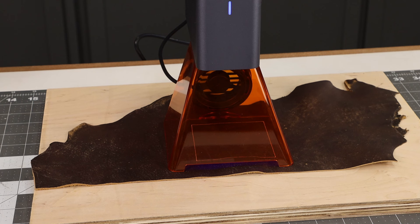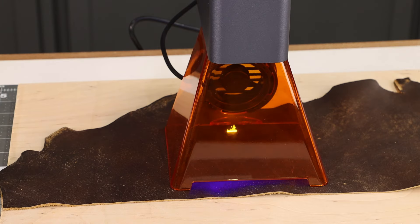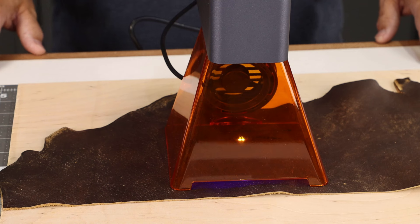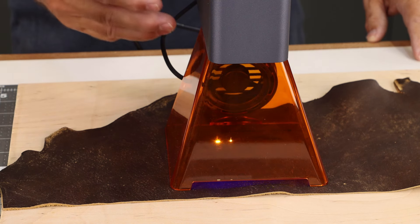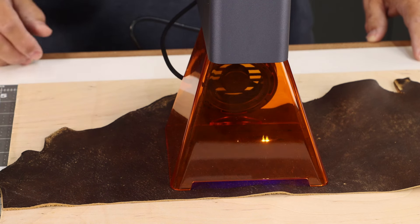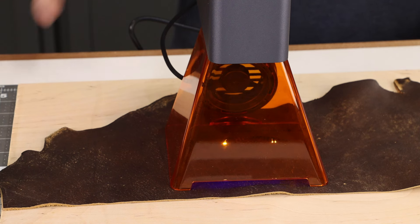I've been thinking about engraving some leather pieces, so we'll start with a sample here. The preview looks good and everything's where I want it, so we'll proceed. I'm using the predetermined leather setting which runs at 100% power and 3% depth and it'll make just one pass. This will move along pretty quickly in leather mode. Do get the fan running because although this built-in exhaust fan will bring the fumes outside of the guard, it really doesn't clear your workspace — so open a garage door and keep a fan running during this process.